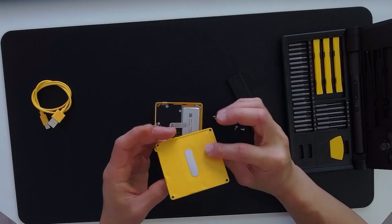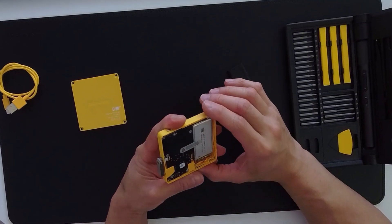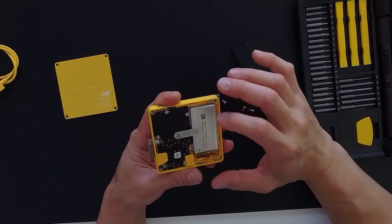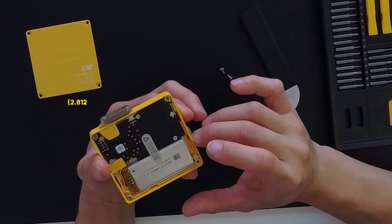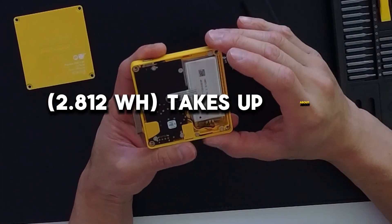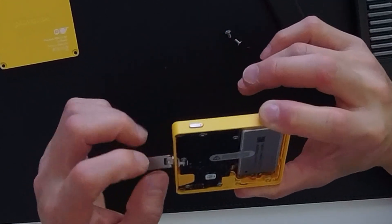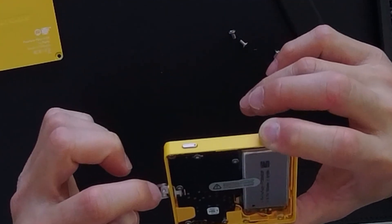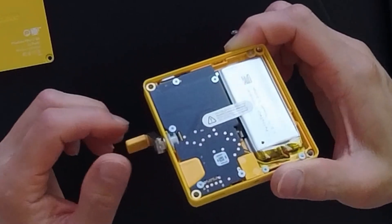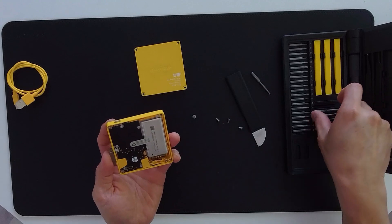And voila! As a part like this, it's really difficult to maintain flatness across a flat surface. Inside, you immediately see the PCB board that's fastened down, and then you have a large battery pack — 760 milliamp hours, 3.7 volt, 2.812 watt hours — taking up about 40% of the volume within the case. As far as the crank goes, there are detents, so there's probably a spring in the crank handle that pushes on a ball bearing, which makes contact with each side of the detent to give that nice registration.